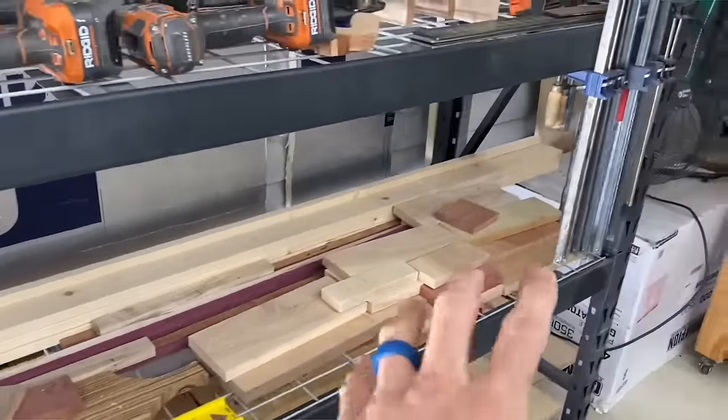Number five is: always avoid storing your lumber in a damp or humid place or environment. Sometimes that can't be avoided, especially if you live in the south like me, but adding a dehumidifier really helps. Keeping the garage door shut will also help if you're able to. If you don't have a suitable space, storage sheds can also work — just try to keep everything up off the ground and covered so that it's not damp or wet.